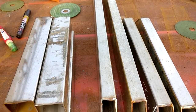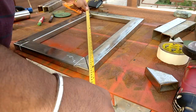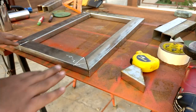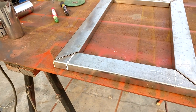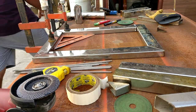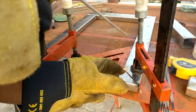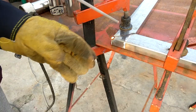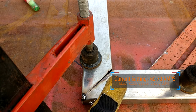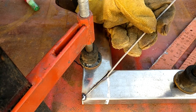For any project the main key feature is to keep the job as square as possible. Sometimes it's not easy to use a set square to measure the straightness of the frame, so you can measure the diagonals — if they are equal it means the frame is square. After clamping the job, I start the tack welding. Here I have a small gap and to avoid a blowhole I use a filler rod.